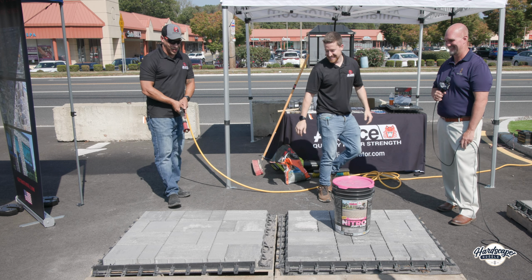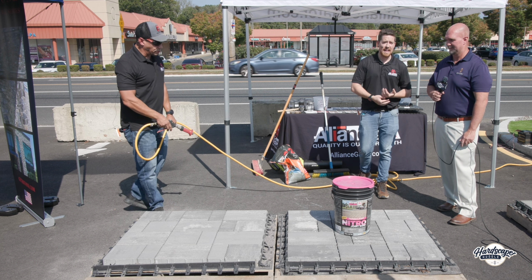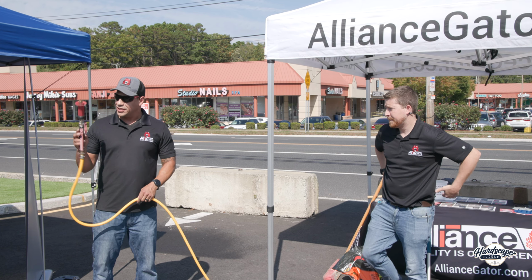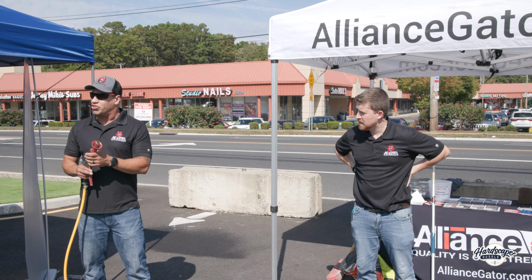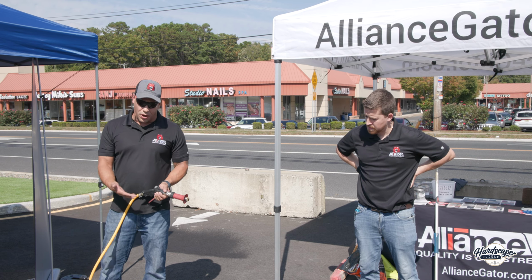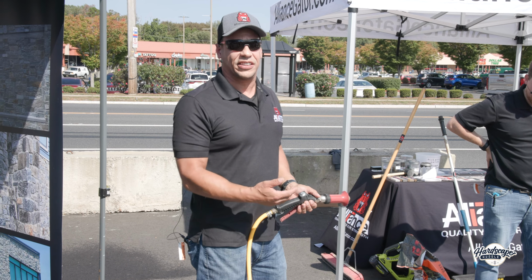Right. After he did his compaction, we swept it off. It's a nice clean surface. Now we're going to go on to the watering process. What you want to use is a garden hose with a shower setting. The reason is you don't blow out the sand, it lands right on top of it, and you get a lot of water coming out at the same time.